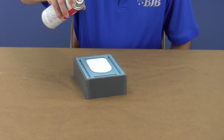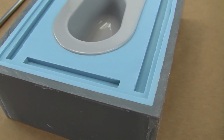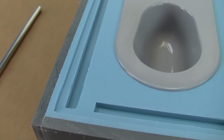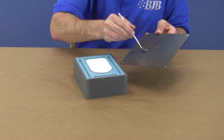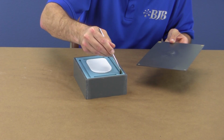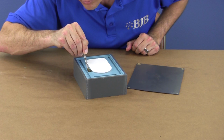The aerosol cans do a good job of applying a uniform mist coat of release, but details like our alignment keys can present a challenge due to their depth and inside angles. An easy way to deal with this is to spray onto a separate surface and manually apply mold release using a small acid brush. I'll also brush around the edges of the master to ensure I have coverage right up to the split line.